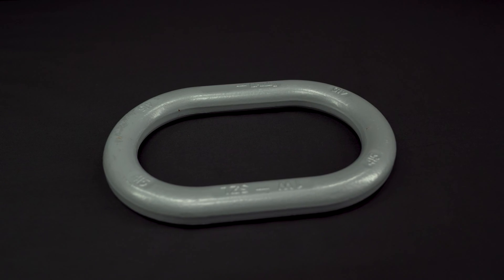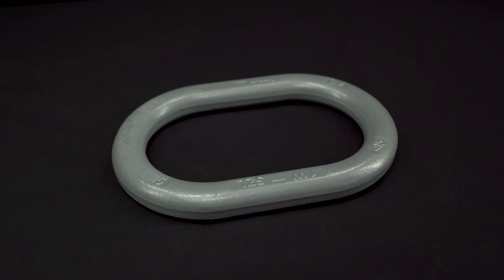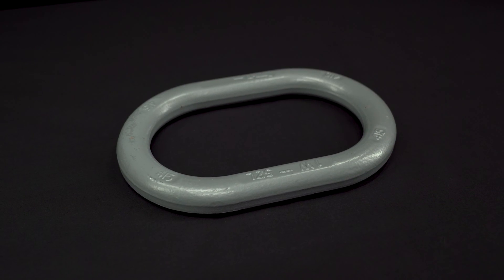I referenced earlier that you gather all of your sling legs — as in multiple — but you don't have to have multiple legs to use a master link. We do offer on our website at Lifting.com different slings that are a master link on top and a single sling leg coming off the bottom. That could be appropriate because you need to connect that sling to a larger hook overhead and you need the space offered by a master link to do that. If you just have a thimble eye on top of your wire rope assembly or a standard sling eye, it might not be big enough. Plus these take quite a bit of abuse compared to a wire rope. This master link is actually forged all the way around — not even welded — and made from grade 100 alloy steel, so it takes a lot to eat at and deform this type of link.